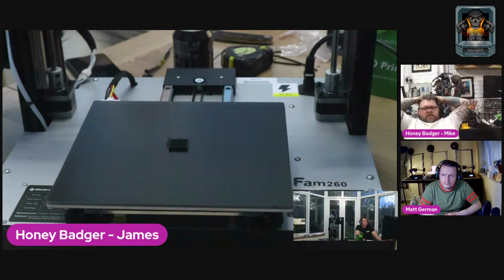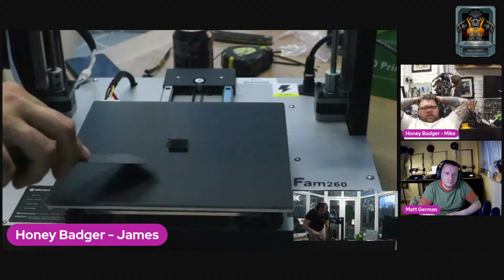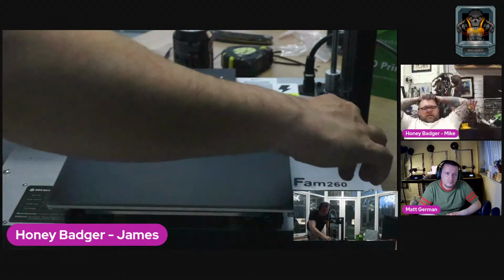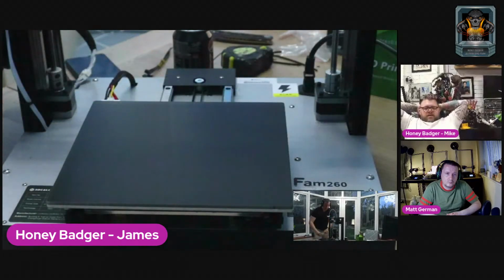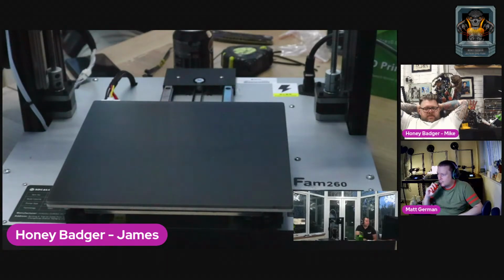So the first thing I would say is that what was 15 minutes in their slicer is 28 minutes on Cura. Wow. So obviously their acceleration settings or something are completely different in Cura. I mean, again, I'm using a Sidewinder profile that I've just changed the bed volume on. So I don't know if I'm perhaps supposed to change something. It's still on 0.2 layer height, yeah. See, obviously, Cura changes all of your wall speeds and travel speeds and everything like that. I wonder what they're doing on 3DTalk then.